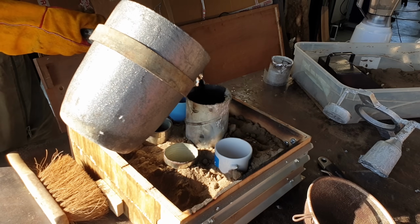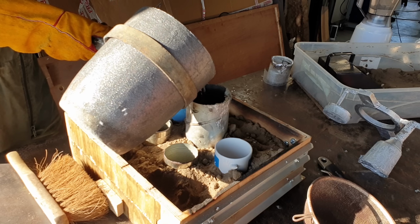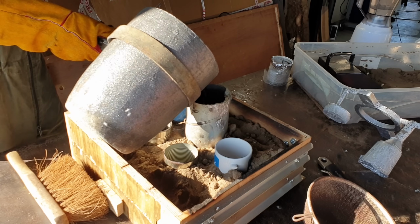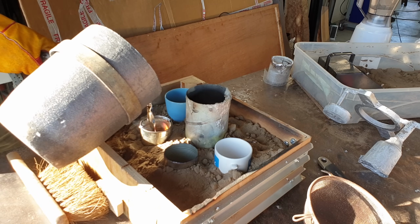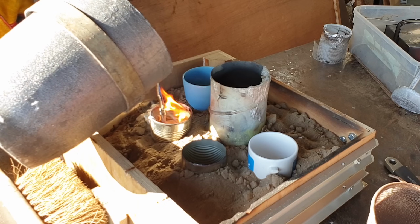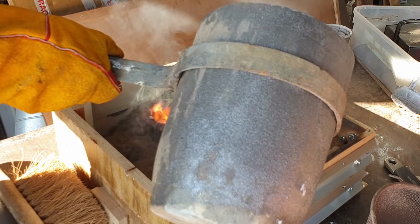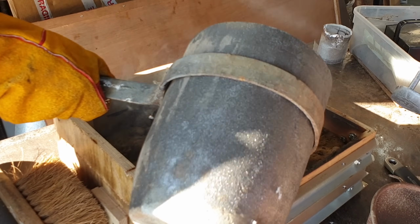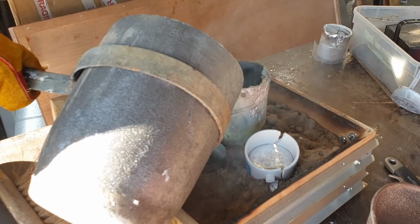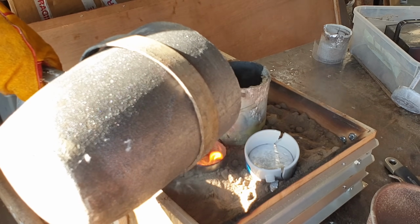If you caught the last video, you will have seen me cast and make some pipe clamps. I did a T5 heat treatment of those pipe clamps, but it was only recently that I really learnt you could do such things at home in a standard kitchen oven. I was really surprised at how simple a T5 heat treatment is, so in this video I want to go into the details of how it's done and to look into the tangible differences between a heat treated part versus one that hasn't been heat treated.